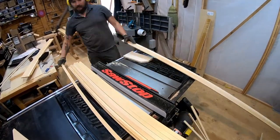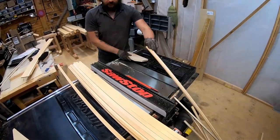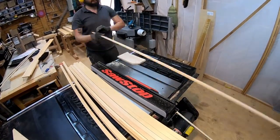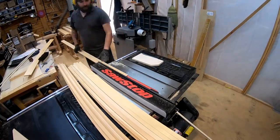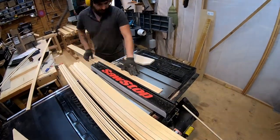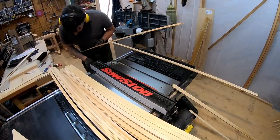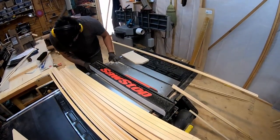I know I just spoke about not wanting to table saw most material, but because these screens are constructed in a way that self-corrects for any twist or warp, it's not a huge deal that we're ripping these down after milling them to size.